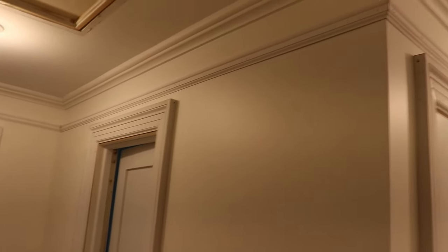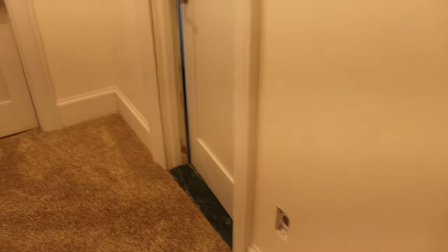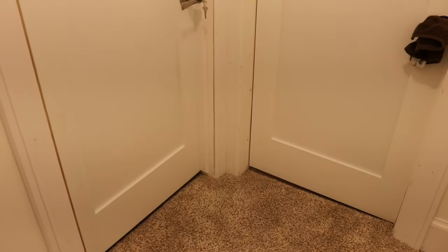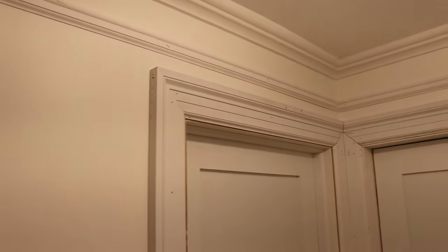You can see where I shot across the tops of the doors. For a staircase you use way more trim for the picture rail because you don't have any baseboard in that area, so I came up kind of short. These doors were put in too close to each other — the past is the past, but if you're building a house nowadays put in all 36-inch doors and make sure they're a foot from the corner. You'll figure out why if you don't.